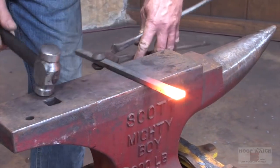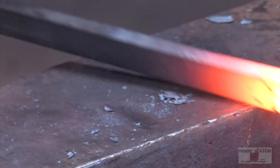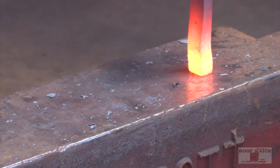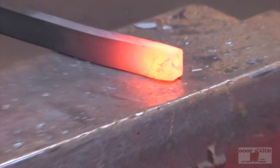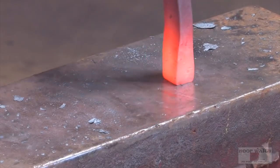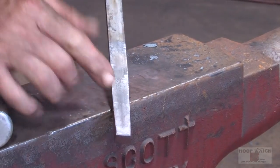I've got a nice tapering heat that kind of dwindles into nothing. I'm already gonna start establishing a wedge shape — it's not going to be perfectly square. I'm angling; my hammer will tip over and I'm angling at this side, just trying to get everything straight in there. You have to forge enough to get rid of your crease. If you just narrow it up you end up getting a crease, so you want to keep that flat.